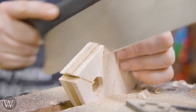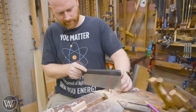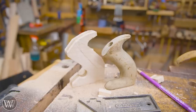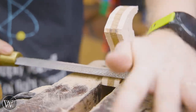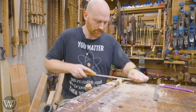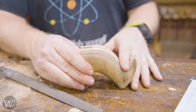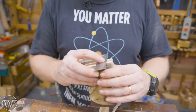One thing you always want to think through when making a tote: leave it large because you can always take off more material — once you go too small you start running into problems. You can make it whatever shape and size you want; you can put indents for your fingers. I'm going to come in with a carcass saw or crosscut saw and cut down to the holes, taking notches out here and there until we get the rough shape. Then I'll grab my most heavy-duty rasp — a cabinet rasp is an amazingly fast tool — and take all that material down to roughly the shape and size I want.